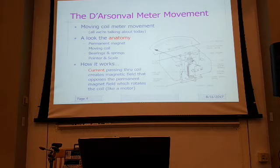But have you ever seen these little Triplett 310s? These are great little meters, really great little meters. I know a few years ago it was still made. This says type 3 suspension, but it doesn't say taut band specifically. But I've actually got one that says Bell System right on the label, and the voltage scales are different than the standard 310. So the Bell System must have said, all our techs want these meters, but we don't want a 3-volt scale, we want a 10-volt scale or something like that for the things they need to measure out in the field. It's kind of interesting. These are great little meters if you ever see them.